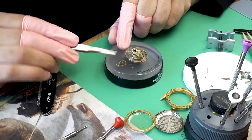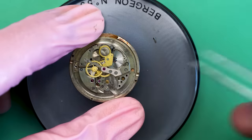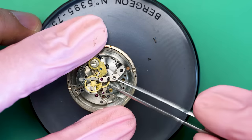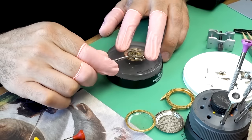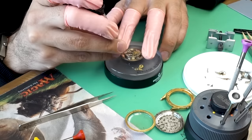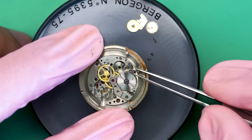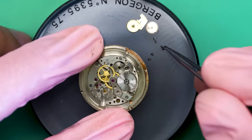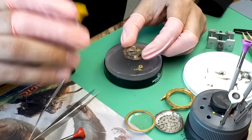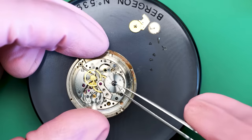I'm taking apart the watch on this gel cushion, which I don't normally do, but the dial is still attached and I just don't want to get it scratched or bent. As you can see, there is still power coming down the mainspring, which is a good sign — we've got power going through the spring and the train of wheels. Now we can take out the automatic winding works gears. These are what transfer the back-and-forth motion of the bumper into actual winding. And this is a click, and there's a click spring — it's a long, thin spring that kind of reaches around the wheel.